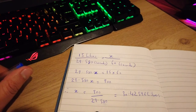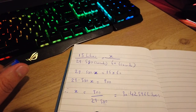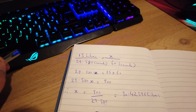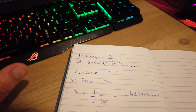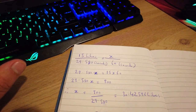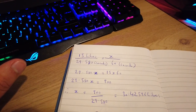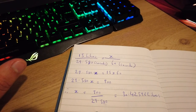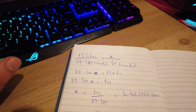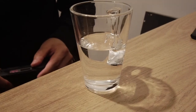This will help you determine the type of pressure washer you're able to buy. If your tap is only producing seven litres per minute, it is nigh on impossible to run a pressure washer that demands eleven or twelve litres per minute. You need to ensure you work out your flow rate first, and based on that result, determine the type of pressure washer you can buy.